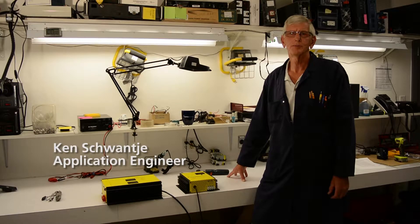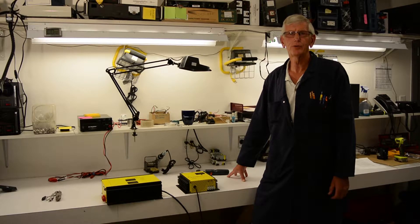Welcome to Samlex Workshop. Today we're going to talk about how to change the voltage — the standard voltage that our battery chargers are wired for, which is 120 volts, to 230 volts. The frequency itself doesn't matter, either 50 or 60 Hertz. These are switch mode power supplies, so they will take either frequency. But on our battery chargers, they have a strap inside that needs to be changed for either 120 or 230.